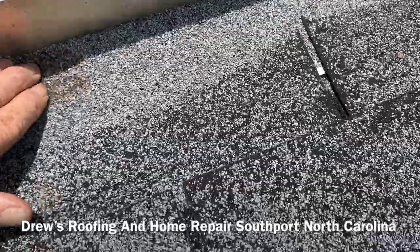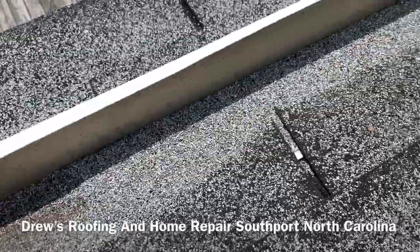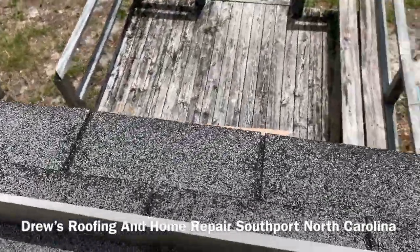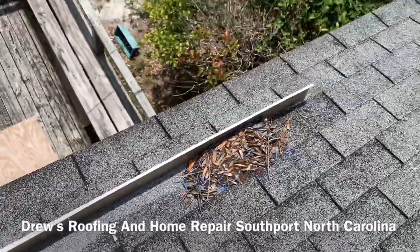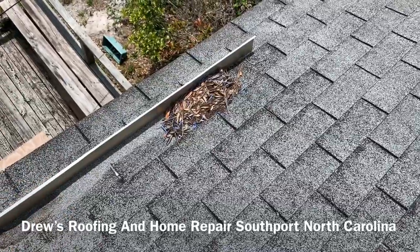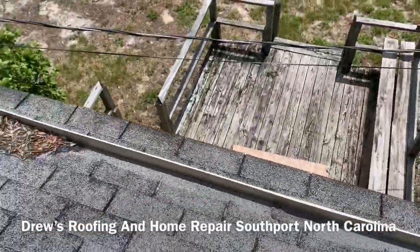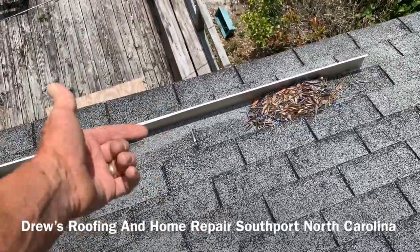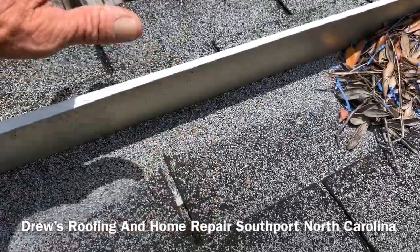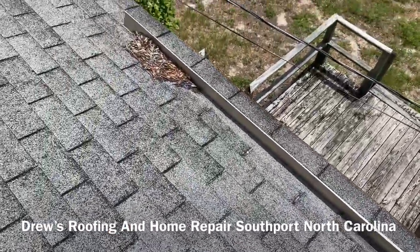You don't want to do that. This thing's going to fill up. They didn't put it at any angle — they just kind of squared it off here. They dropped that in down there maybe a quarter of an inch. Not enough. You want to give it about three inches — drop it down three inches. You want a minimum of six inches at this end, nine inches at that end. So I would go nine by three or three and a half, and then put a little lip on it to keep the water that rushes down from splashing over it. That's a rain diverter over a door.